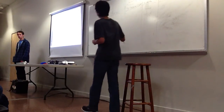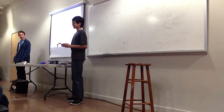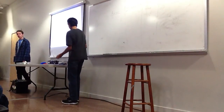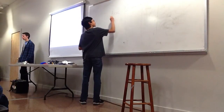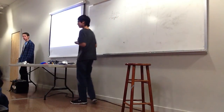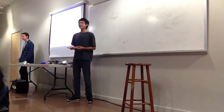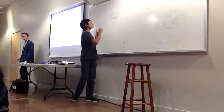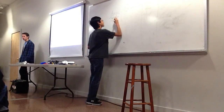So I'm going to start with arms. Really basic. Make an arm. It's attached to a motor, it goes up and it goes down. The big advantage of that one is it's really simple. It's not very complicated. It's a motor attached to usually a C channel, and it just goes up, and it goes down, and it can raise the thing. The problem is that it takes up a lot of room because it doesn't bend.